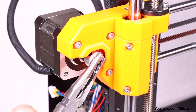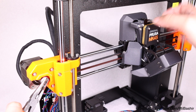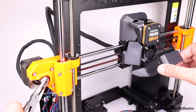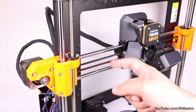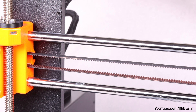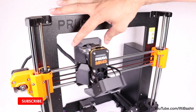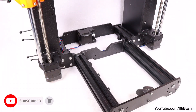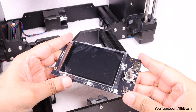For a final manual check, grasp the flat part of the X-motor shaft with pliers to prevent rotation, then gently try to move the extruder towards the X-motor. If the belt is properly tensioned, you should feel resistance and the extruder won't move at all. If the belt is too loose, it will deform and jump over the pulley teeth, requiring re-tensioning. Once confirmed good, the Z and X-axis are complete. The main bed and Y-axis remain, but next we'll cover the new injection-molded LCD assembly.